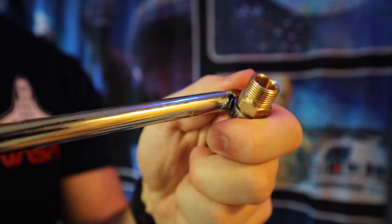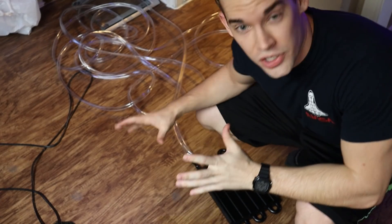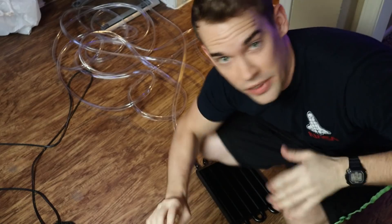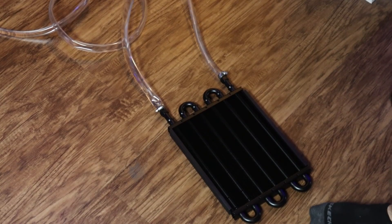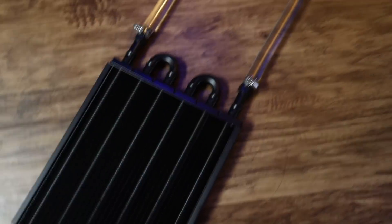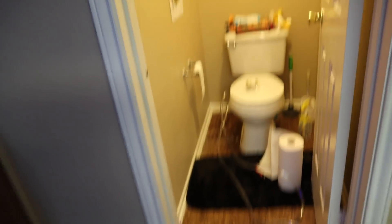I'm not sure how much you can see, or even how much you want to see, but I'm gonna be taking this off. This is really hard to film and I'm sure the audio is terrible, so I'm sorry. Maybe a couple extra twists — does that look watertight to you? I hope so. I'm gonna slowly pressurize the line and see if the water can actually make its way all the way through this and back into the toilet. If you hear me start screaming or see any water, tell me and I'll turn it off. No leaks so far. There it goes, snaking its way through. The water's going — it's getting chilly. That's cold already! It actually worked. Everything is holding pretty tight. There's a lot of pressure on this but I know the pipe itself can hold a little over 45 psi. It goes all the way to my toilet and it filled up the top.